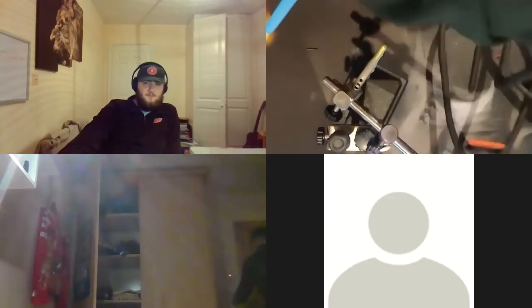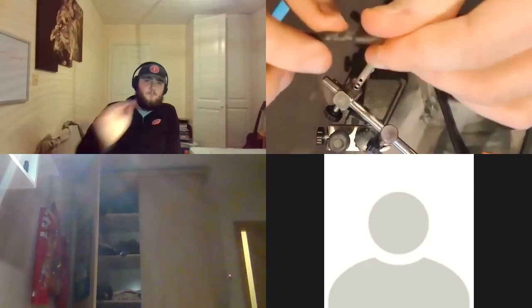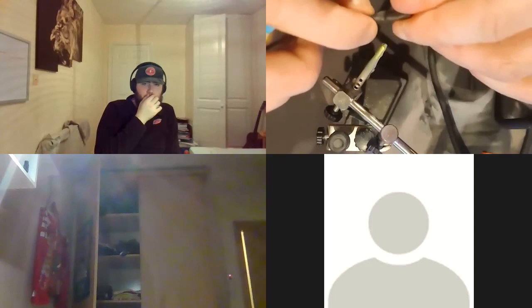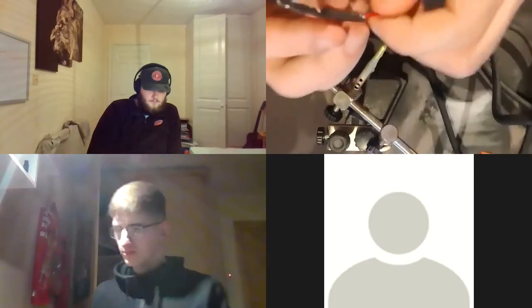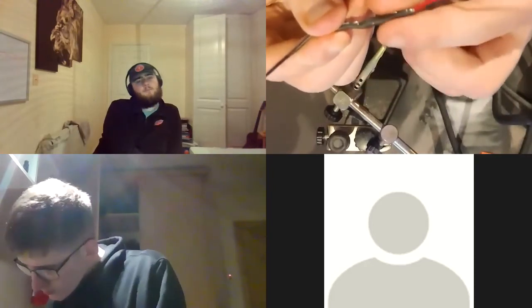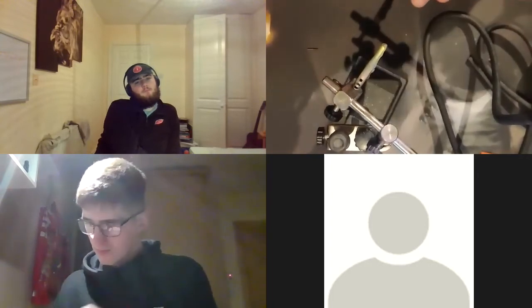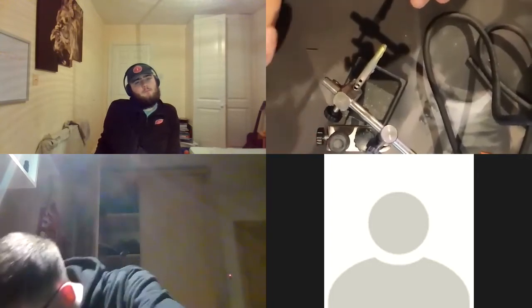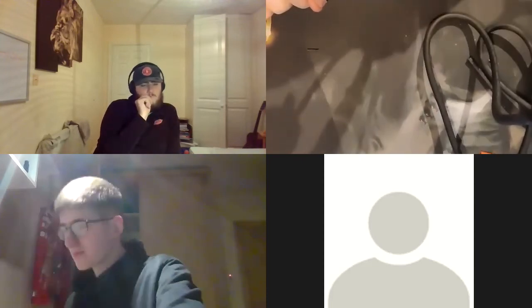So this is super dirty, but you see here the heat shrink tubing has kind of melted around that now. You can still kind of pull this, but I probably used too thick of a piece. You can get it in thinner gauges, so if you use a thinner piece, it'll be flush to it. But that just stops the connection on the inside from being exposed. So now we can move this around, throw it around the place, and the connection on the inside won't sever. I think I'll leave it there. So that was just some rough soldering.